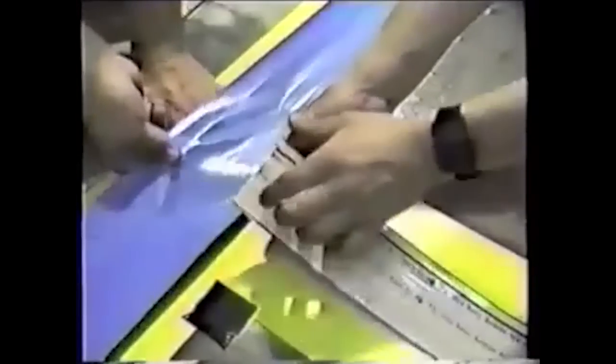For branch circuit cable termination to a main run feeder cable, tap connectors and an insulator patch kit must be installed. Pull back the top protective blue vinyl covering only, approximately 18 inches, on the branch circuit cable. Using a pair of sharp cutting shears, cut the feeder cable's top blue vinyl only, aligning the cut with the center conductor on the branch circuit cable. Do not cut the feeder cable's bottom protective blue vinyl covering.